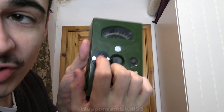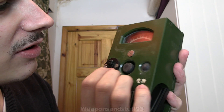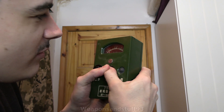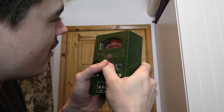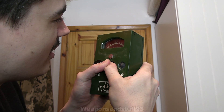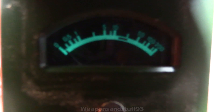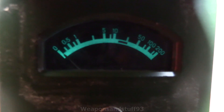So I assume this is the on/off switch — and that's what that's going to indicate. So that is going to be on. Now I'm sure that's the check source button — and there we go, the needle is rising ever so slightly. So half a Rontgen per hour, but it's still going up. I think it's stabilizing on 0.5 Rontgen per hour. Non-linear scale — so if you look at that, and it glows in the dark too! The dial goes up to 200 Rontgen, non-linear.